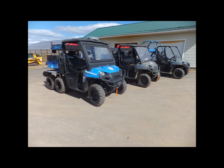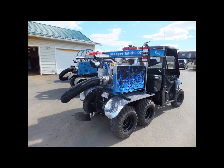This video will be the first in a series demonstrating the Trident pump's versatility. In this video, we have a 1500 gallon per minute impeller installed in the unit and will be demonstrating flow at water level, then at distance and height.